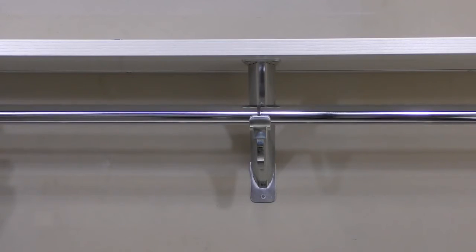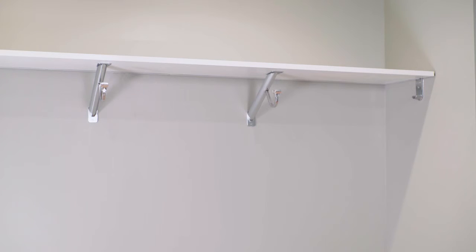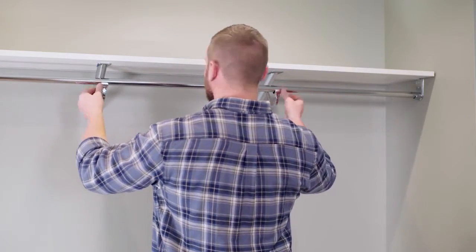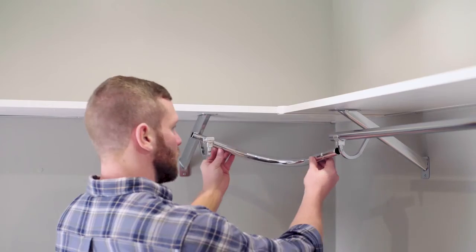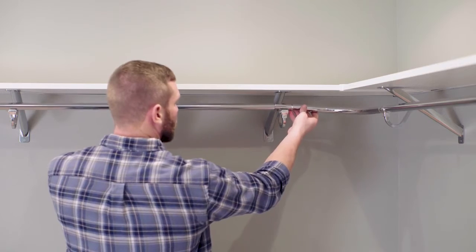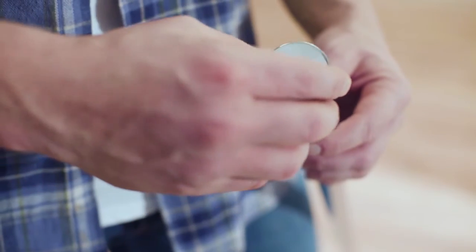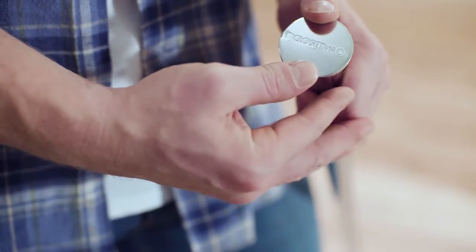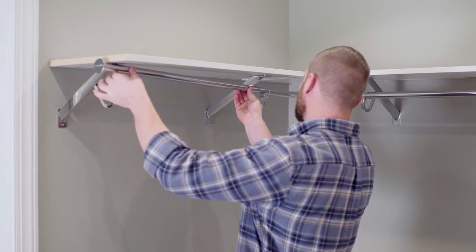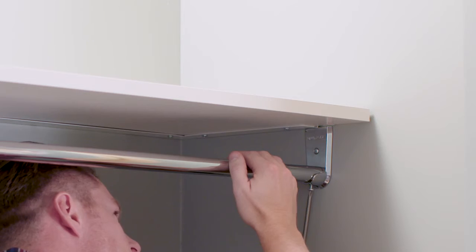Let's determine the closet rod lengths and begin installing them. Seat the joiner piece on the support angle bracket cup. With all three rods cut to size, install the first rod into the universal pole cup and snap the rod onto the support angle brackets. Then insert the corner rounder hang rod. Next, insert the rod along the back wall. With the rod in place, install the second corner rounder hang rod. For the last closet rod, insert the end cap and screw it tight, then insert the rod into the corner rounder hang rod and snap it into place. Finally, use self-tapping screws to secure the closet rod to the universal pole cup.